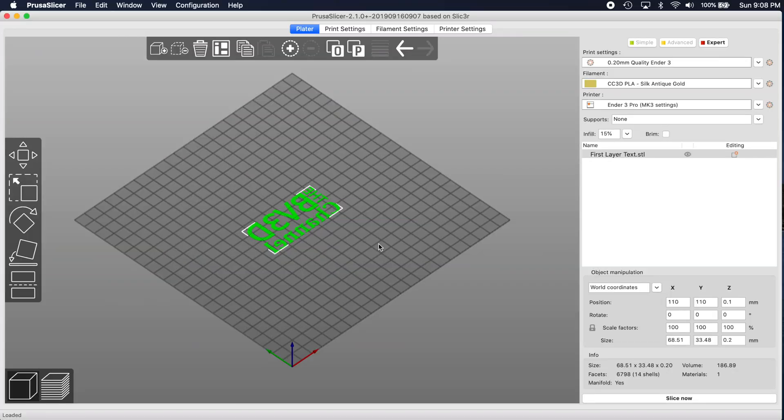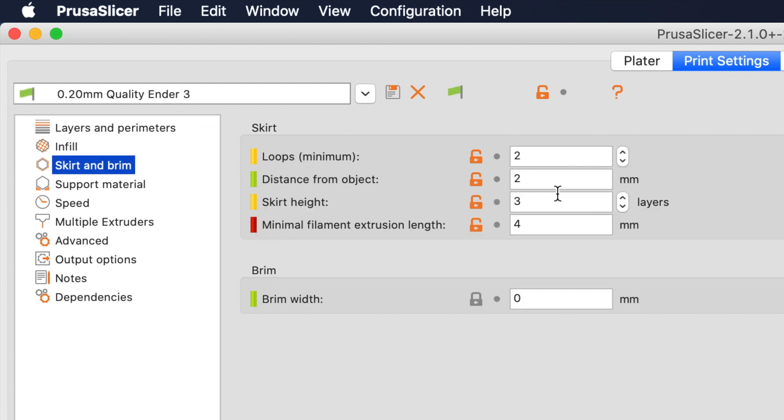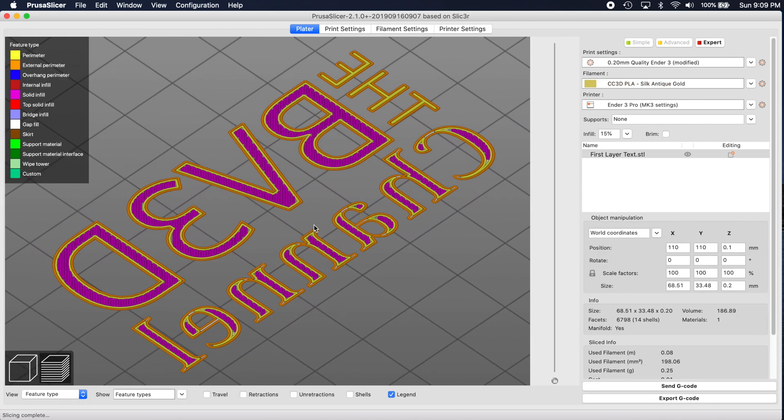The skirt we don't strictly need since it happens immediately after the priming line, and it could get in the way between prints. But the skirt is an easy feature to turn on or off. Here's how to do it in PrusaSlicer: in the Print Settings tab, click the Skirt and Brim category, and then change the number of loops for the skirt to zero. Other slicers should have a similarly named setting. But if you find that you can't turn the skirt off in your slicer, that's okay too — in between printing the text and printing the card, you can simply remove the skirt from the print bed. So we've got the skirt turned off. We can pick the filament that we want, slice the model, and then save the g-code file. Let's save it as card text.